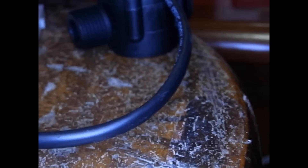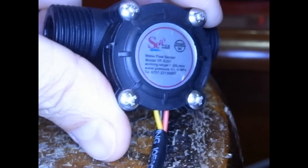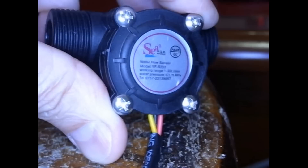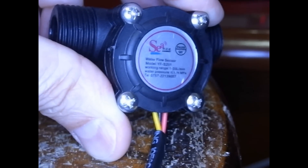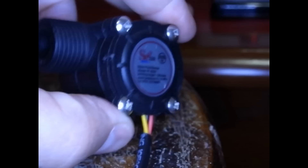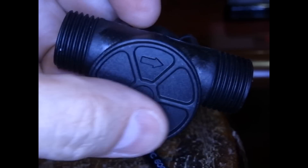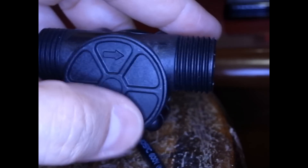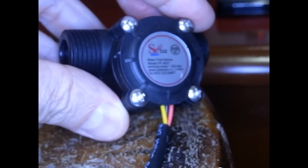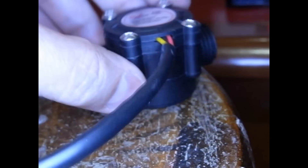Let's follow this back over here. This is our flow sensor — it's the YF-S201, it's got a working range of 1 to 30 liters per minute. You can see the impeller inside there, and it's rather simple. It's got an arrow on it which tells you which way the water flows. The water comes in from the left side, goes to the right side, spins the impeller. There's a little magnet on the impeller, and the magnet triggers a Hall Effect switch, causing pulses to come back to the Pi.